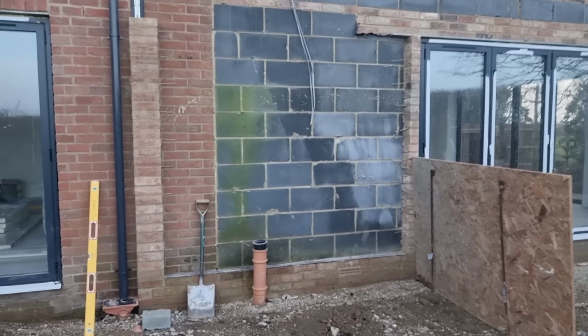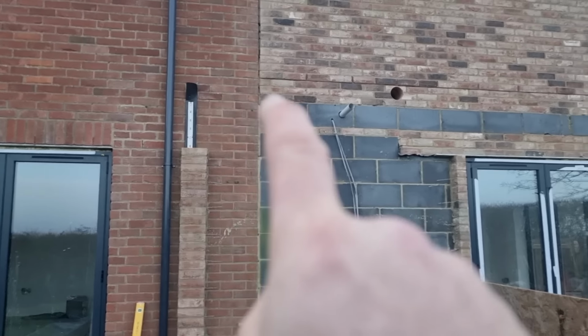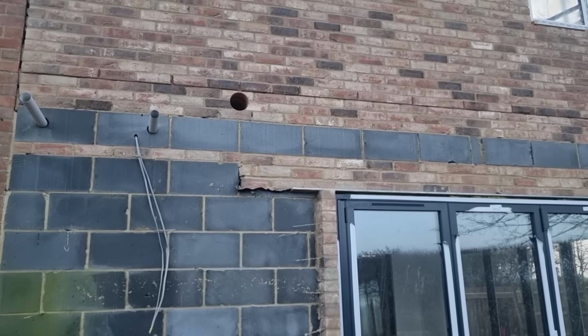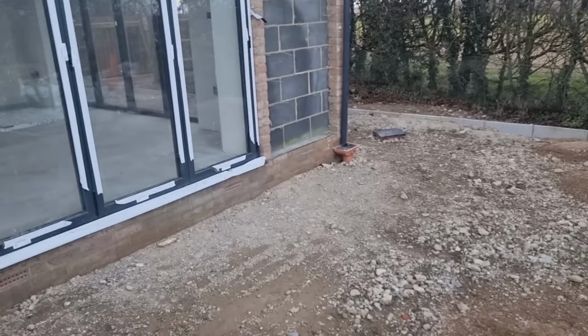And the job I'm undertaking is behind me here. It's quite a big job. A lot of flintstone. It goes between here. What we see here goes right the way up. I've then got to put a soldier course right the way across. Just underneath, you can see where the lead line is going in. The lead line's been cut out, so I'm going to be a few courses below that. Right the way through there, and then back down the other side. So there's this big panel of flintstone to do, and around the other side, well, there's loads of panels. Loads to do. So, this is the first one.